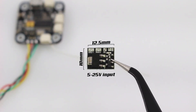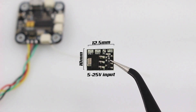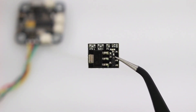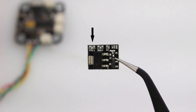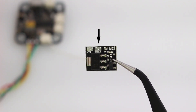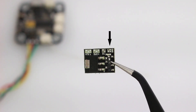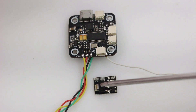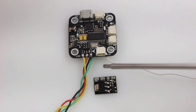To get your Real Pit to work, you will need a free UART on your flight controller, and it can be soldered to either the transmit pad or the receive pad. Looking at the pads, you'll see the VTX plus — that's the power going to your VTX — the battery plus where battery power comes in, the FC pad that hooks up to your UART, and a ground pad. Wiring it up is pretty straightforward: you simply provide power to this in between your power supply and your VTX.